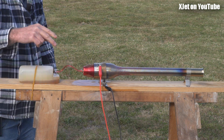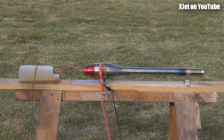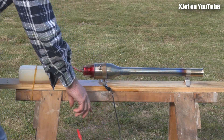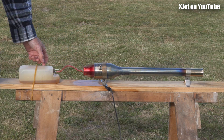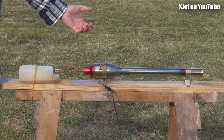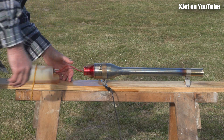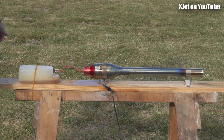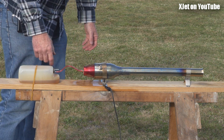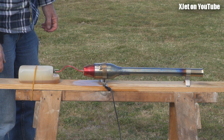There we go - it runs! The Hobby King pulse jet runs. The key things we've learned: we needed a larger opening in the fuel valve - a fuel jet - to let more fuel get through into the motor. There simply wasn't enough before; it would burp and fart but wouldn't run. Also we had to have the combustion chamber preheated so we'd get some vaporization of the fuel. It's quite cool here today, and on a cold day you don't necessarily get the vaporization you need.